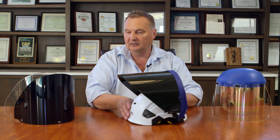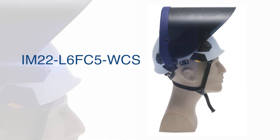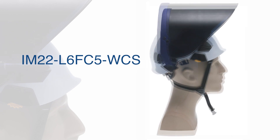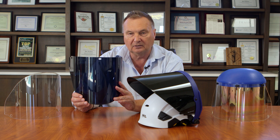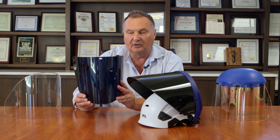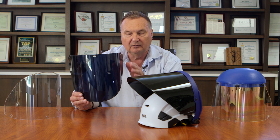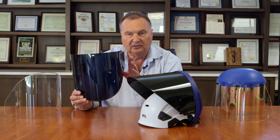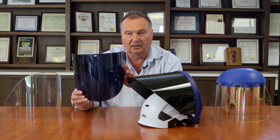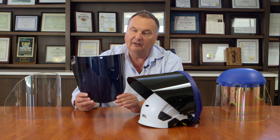We have a lot of other face shields here. This one is the IM-22 L6FC5 WCS — a cobalt colored face shield that is also shade 5. It's protecting against UV, visible light, and infrared. In the visible light spectrum, it has a special blue color that allows you to see the slag on the surface of molten steel.